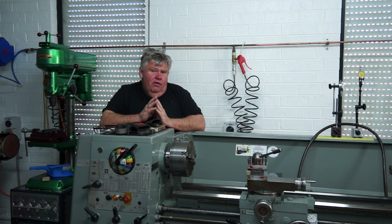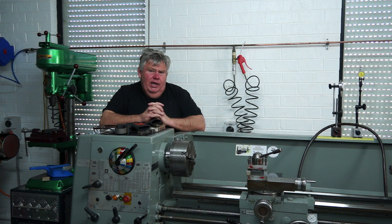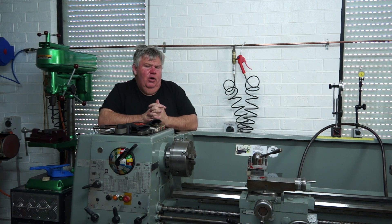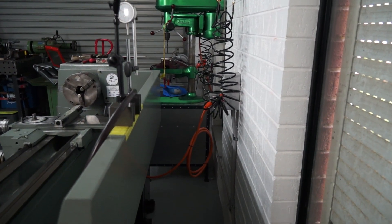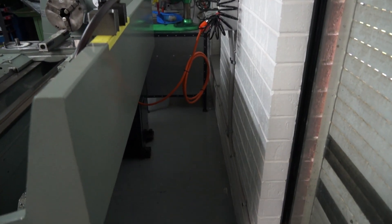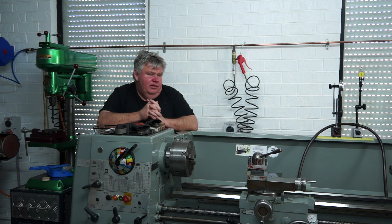Overall I've finished the levelling and I'm quite happy with it — time will tell, I'll let it settle a little bit. I started to worry it might have a slight twist in it, but I highly doubt that. This casting is as strong as malleable and I don't think it's got any twist. To put it this way, I could adjust one of the front jacking screws on the headstock and it would actually affect the tailstock, kicking it up a little — it's that rigid and solid. Definitely Colchester made a good lathe back in the day.